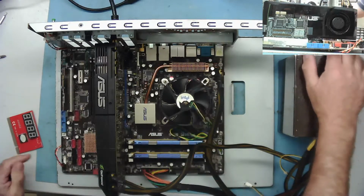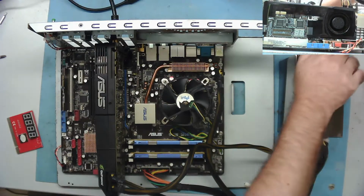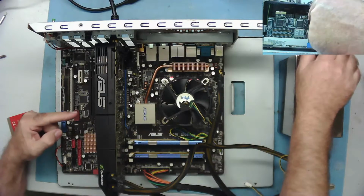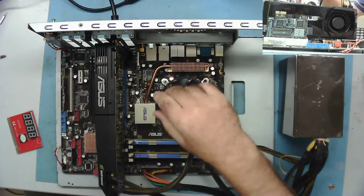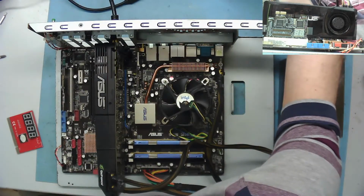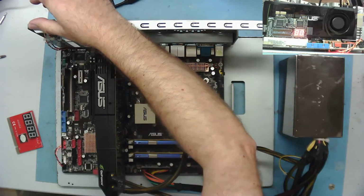So that's plugged in, we're all connected up. There's a little green light on here, which I guess is telling us that we have standby. Yeah, 3 volt standby, so we know the 3 volt standby is here. That's a nice little thing on this new card. I have the monitor connected on the DVI. I'll just set it to DVI input, and we'll just switch it on and see what happens.